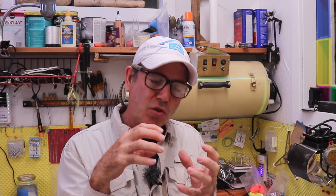When it comes to lights, there are two really important things: the wavelength of the UV light and the wattage — specifically wattage density. Wattage density is a little difficult to calculate; it really is just how much of that light actually gets to the object, which means lots of light really close to the object. 365 to 395 nanometers is the sweet spot for this kind of resin. There are industrial resins that prefer a shorter wavelength, but I don't recommend that — it's harder to find those lights, they're more expensive, and the radiation is more harmful to your eyes and skin.